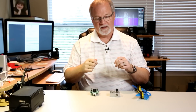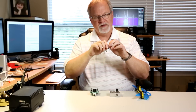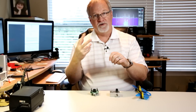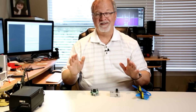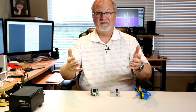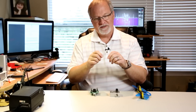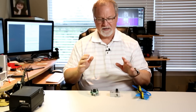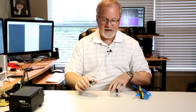It's just simply a round magnet that you pass a wire through and you count the number of times you pass the wire through — it's just like sewing. The only way you can screw this up is failing to strip the enamel off of the wire so that when you solder it to the board, you're soldering directly to the wire instead of soldering around the enamel. That's the only way you can screw up a toroid. So just be careful once you've wound it and you're ready to solder — make sure to strip all the enamel off. Don't be nervous about winding toroids. There's just nothing to it. Trust me. So having said that, go get one and I'll talk to you later.